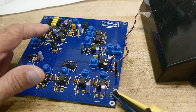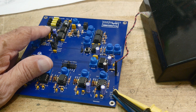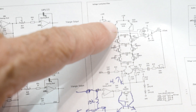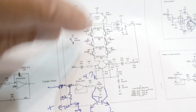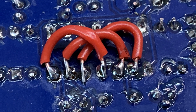What I've done is - I had one transistor left over from the package, it's five transistors in one package and I was only using four. There's one transistor that's left over, and pin 13 is over here. So what I did was I lifted up the legs of the package so this transistor does not make contact any longer, and then I just wired these pins to these pins - I paralleled them electrically. Now this transistor is taking over the job of that transistor, and pin 13 is now just floating. So it works!